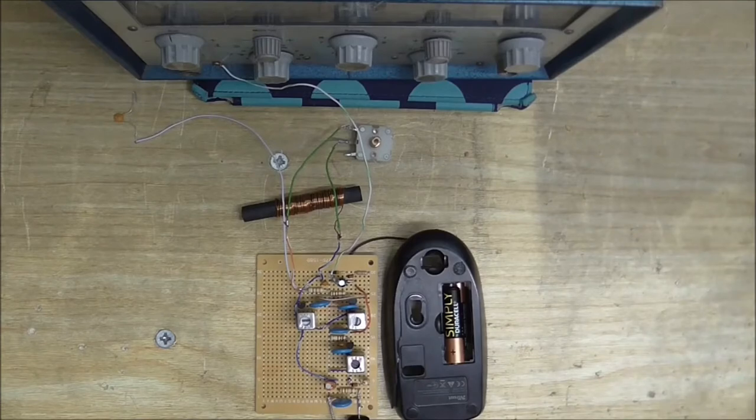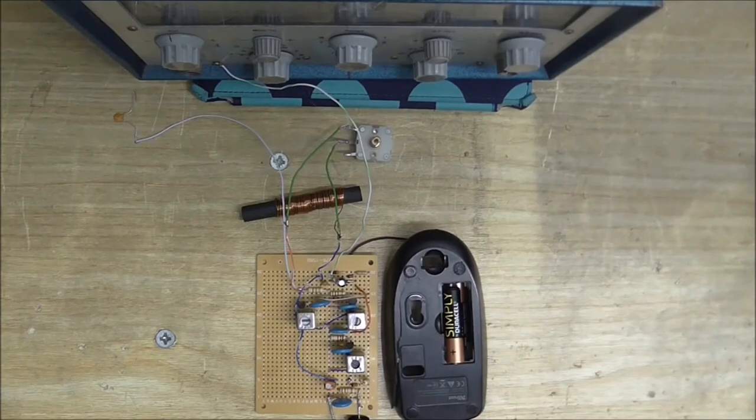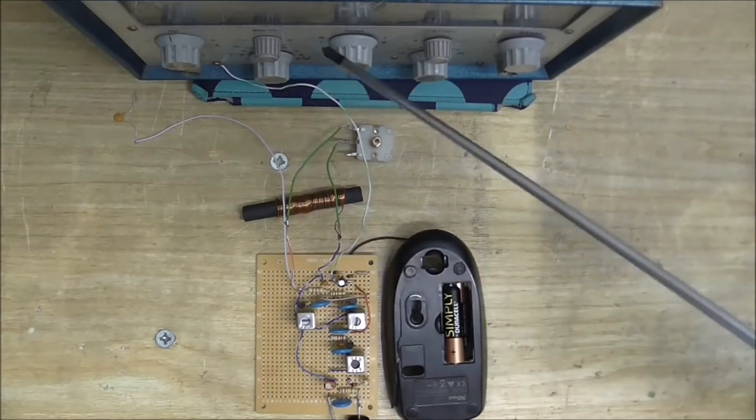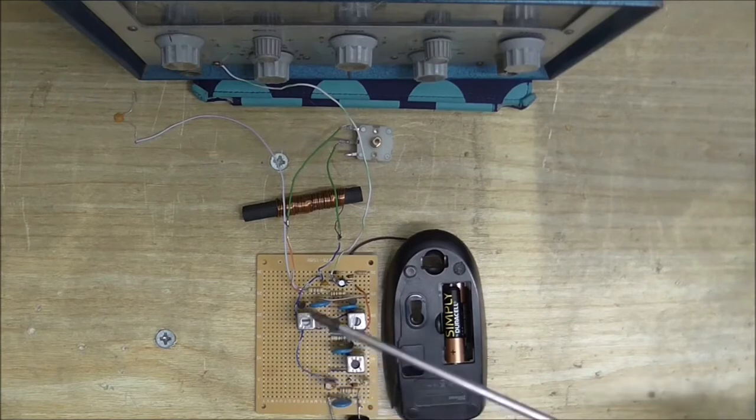Well, one thing is that the third frequency that you get never changes. No matter where you're tuned, it always stays the same. So what is that third frequency? Well, it is the difference between the frequency of the incoming radio station and the frequency of the radio's local oscillator. And in most AM radios that will be either 455 kHz higher or 455 kHz lower than the frequency that you're actually tuned into. So that makes that third frequency 455 kHz, because that is the difference between the two frequencies.